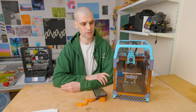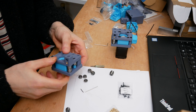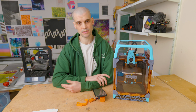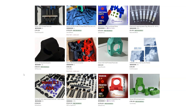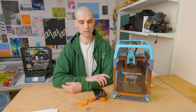With these Voron 3D printers, they do use 3D printed parts. You want to print them from ABS — you don't want to use PETG or PLA because it will warp under higher temperatures. If you're unable to print ABS like me, there are a few ways to get these parts. First, AliExpress, Etsy, and eBay all sell 3D printed parts, though there is quite a high markup compared to printing yourself.